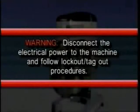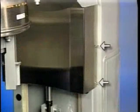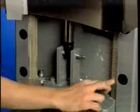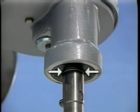Warning: disconnect the electrical power to the machine and follow lockout/tagout procedures. The slideway should be lubricated approximately twice a year. To reach these areas, fully lower the bowl support and remove the apron secured by thumb screws. Wipe a thin coat of Lubriplate 630AA on the bowl pan area of the bowl supports and on each slideway, then reinstall the apron. Occasionally the planetary seal may become dry and begin to squeak — to correct this, work a little mineral oil under the lip of the seal.